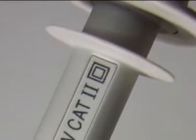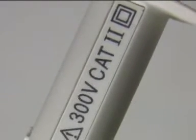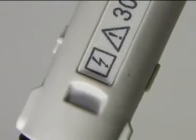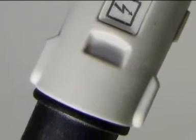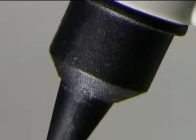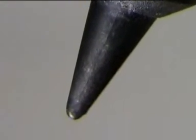So what's inside an iProber that makes this type of measurement possible? The heart of the probe is a patented miniaturized version of a fluxgate magnetometer. Fluxgate magnetometers have been around for decades, but not in miniature form. It is the patented miniaturization that enables it to measure the field at a precise point in space, and in addition to that, the miniature sensor has a much lower noise and much wider bandwidth than a conventional fluxgate magnetometer.